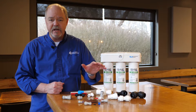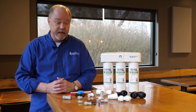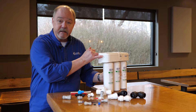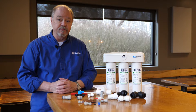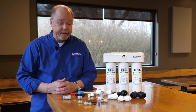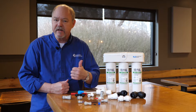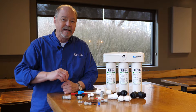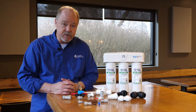Quick connect fittings are used almost anywhere we're moving water, especially for filters and under-counter point-of-use systems. In fact, some under-counter systems like the NeoPure ultra filtration system have them built right in, making installation a snap. They're used for a variety of OEM manufacturing for products that move or filter water. Many are also rated for pneumatic use — compressed air or some level of gas. Always be aware of chemical compatibility with the type of plastic the fitting is made from.